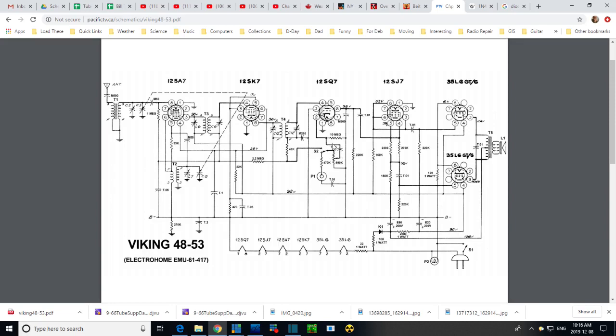Comes through, the audio's coming through, goes up to the triode, out of the triode. Look, only 58 volts on this triode. And then into this tube to produce an inverted signal, a non-inverted one, well, one of the two going here and the other inverted one going here, or the other way around, and then out through the output transformer. 106 volts. We're a little above that now, probably because I replaced this guy, but I don't think there's any harm in that. A couple of volts extra.